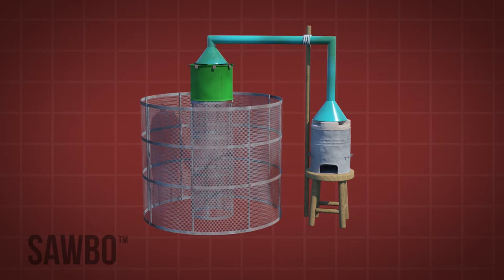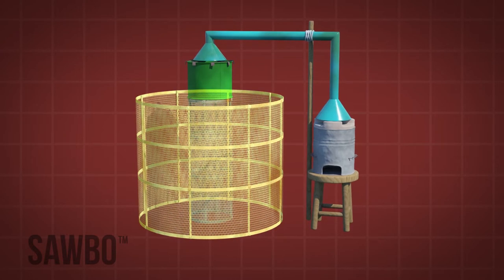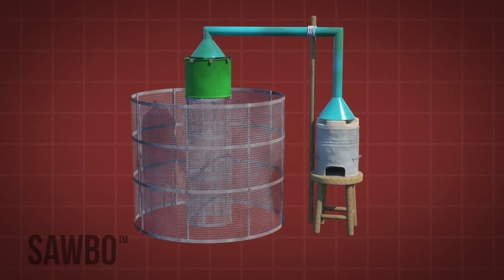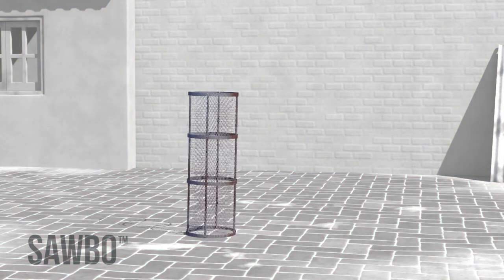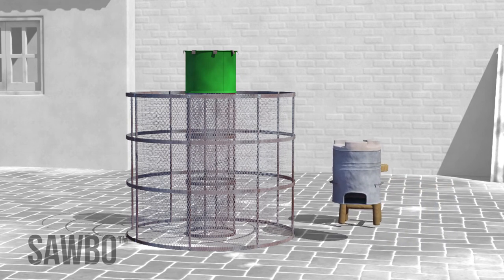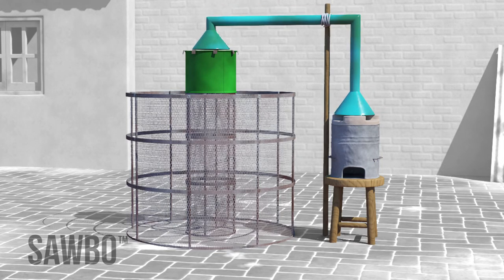The BAU-STR dryer is comprised of a blower, an inner bin, an outer bin, a hot air conveyor pipe, and a stove. The inner bin and outer bin sit on any plain floor. The blower will be on top of the inner bin of the dryer. The stove is placed beside the grain bin, and a steel conveyor pipe connects stove and axial flow blower for hot air flow.